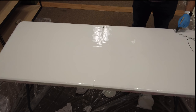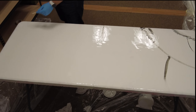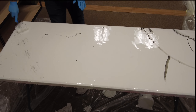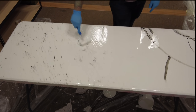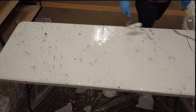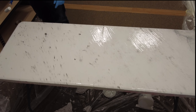From there we're going to add the black pigment to make this into a white marble. This was kind of a test piece. We tried to do it with a foam brush on the right side to see what would happen. On the left side is the normal way we do it — we dab two or three little dots and then take the foam roller and run it over it. The less material you use, the more of a white marble you're going to get. If you use extra material, you're going to start getting more of a deep gray or more of a gray with white and black accent.